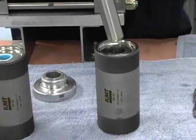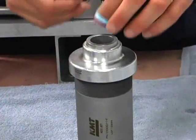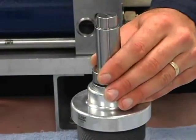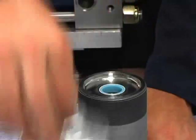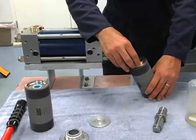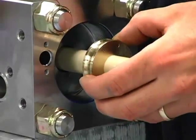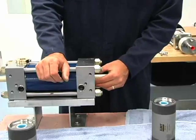We'll flip this one over — backup sleeve in, high pressure seal, and hoop ring. Now you can see this is going to go on over the plunger, and this is where the buttress rides — this is what holds the high pressure seal in place on this end. The new buttresses go on, and this is a very tight tolerance so it should just barely wiggle when you put a new one on there. Push it all the way into the end bell.